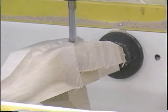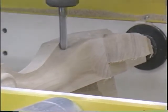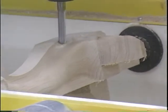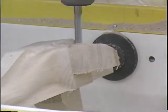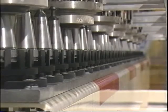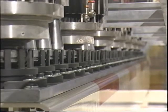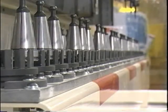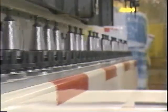The amount of cutter step over determines the cycle time and surface quality. The larger the step over, the faster the cycle, but the rougher the part surface. Smaller step over means longer cycle times, but smoother surfaces. Each company has to strike its own balance. When the surface has been defined, the first tool is replaced and the second tool retrieved automatically on all 8 spindles at the same time. The various detail programs are then executed.